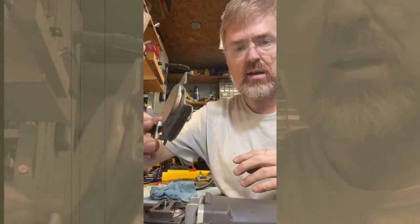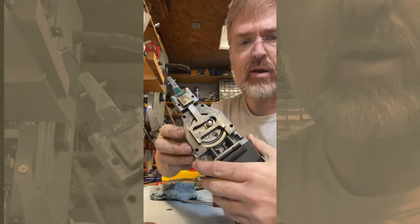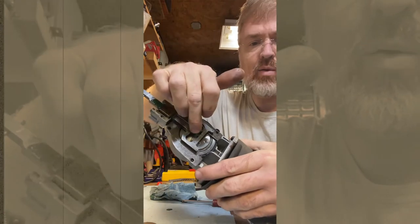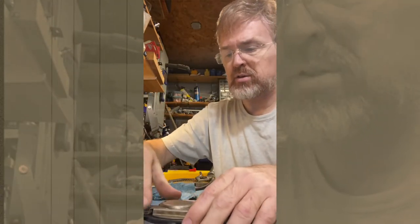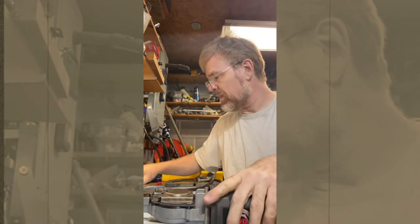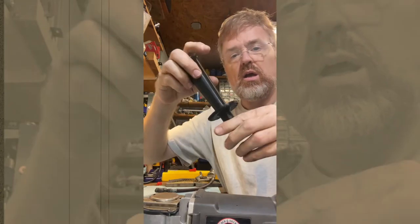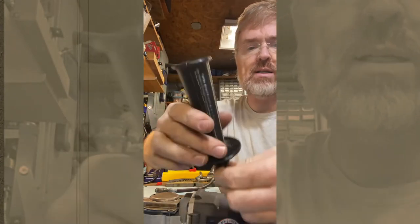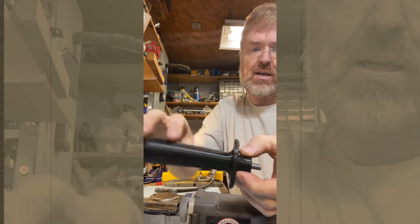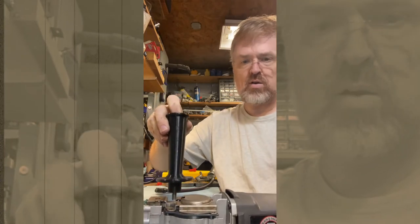This then is the cap to hold everything down. Here is where I initially thought I would drill some access holes to be able to get down in there, but you'd have to get it rotated to just the right spot to access the two set screws, and one set screw is blocked anyway. So I'm just not going to do that — it doesn't take too long to take it apart. Now, the other thing we needed to do is have a handle — I designed a little piece to prototype that, and it would go right in here. I 3D printed this. There's a bolt in there with a hex in the plastic to keep it from rotating, and then the bolt comes down and goes right here. I also made a little part out of aluminum for the handle to screw into, and that goes right there.